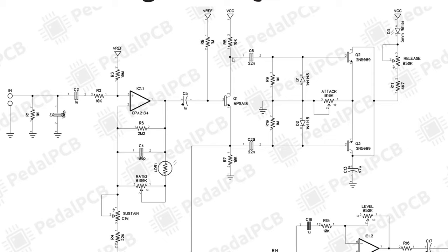After the signals come out on the collector and the emitter, we're going to do some high pass filtering. So that's done by the 22 nano capacitor and the 1 mega ohm resistor here and here. These diodes are nothing really special. What they're doing in this case is essentially they're clamping diodes. So they want to make sure that this DC bias here on the base of Q2 and Q3 never goes below zero. So it's basically just to make sure this stays forward active.